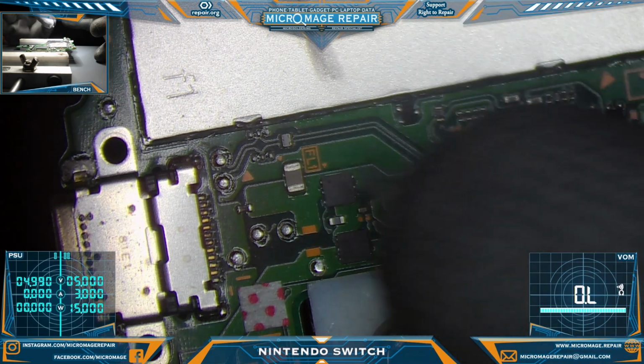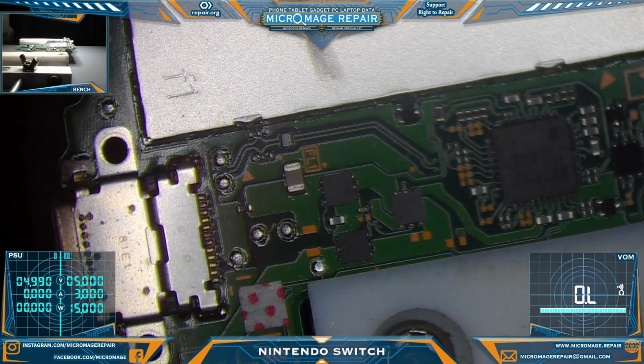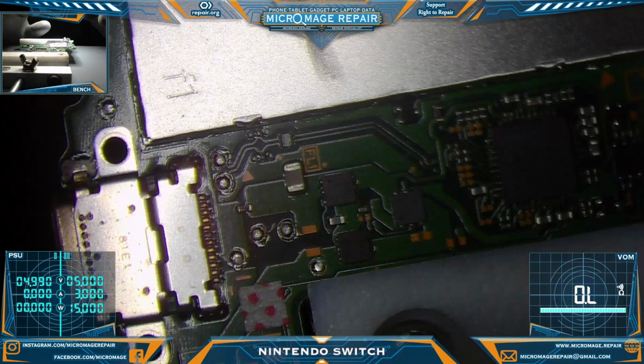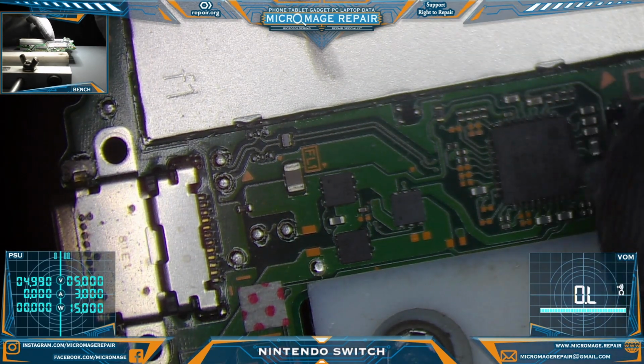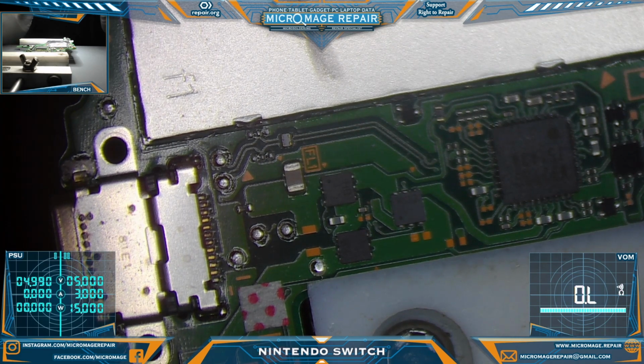If you're not getting 15 volts, regardless of whatever fault, Pi 3 USB, the buck regulators, gas gauge, it doesn't matter. If you're getting communication with M92 T36, at least in my experience, you should be drawing 15 volt, even if you're not drawing amps or anything else. And that is the chip communicating with the charger, telling it what voltage to send.